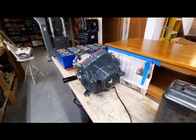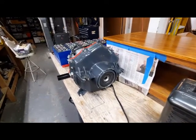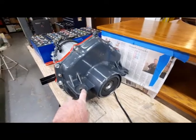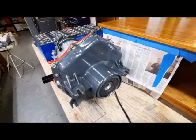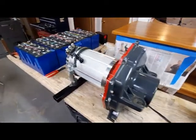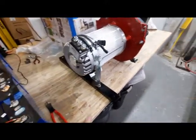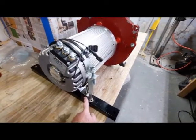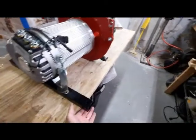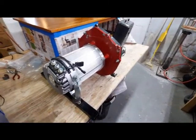I got the motor assembly roughly put together and everything went according to plan. That is in fact what the back end of a V6 OMC looks like — these slots go right onto the inner transom housing of the out drive, and that should line up with the gimbal bearing. Just for fun, I put the clamp on the back end. I've got adjustable motor mounts here — this is tube iron, cut to length. Hopefully the angle irons that this sits on in the boat are at the right height. Every now and then it's nice to see a little bit of progress.